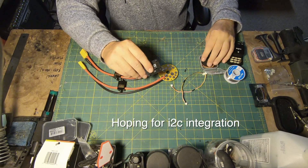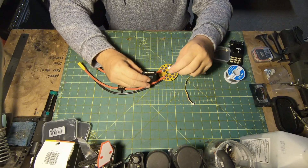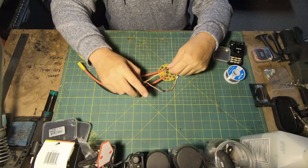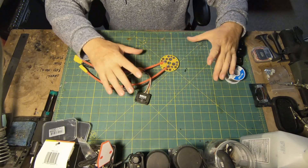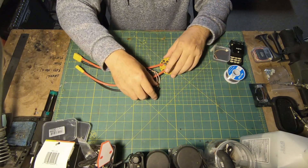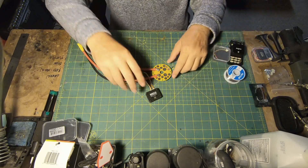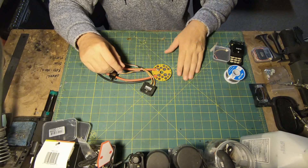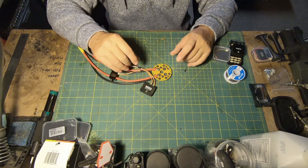I was hoping to tie the 3-pin plug into the Pixhawk system somehow, but I haven't figured that out. The two 4-pin connectors are where the two sensor hubs go in, and the two sensors go into the sensor hub. Planning my build — my plate is fairly large with arms going in multiple directions. In a tight build, you're trying to find spaces for things. I usually cover the sensor hub with some sort of non-conducting enclosure, like a 3D printed piece or cardboard, but it's important to isolate this piece from carbon fiber or other conducting materials.